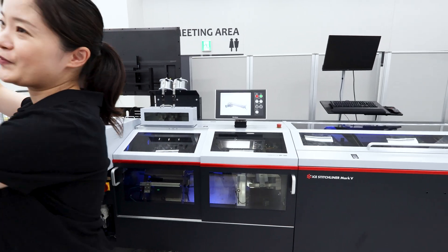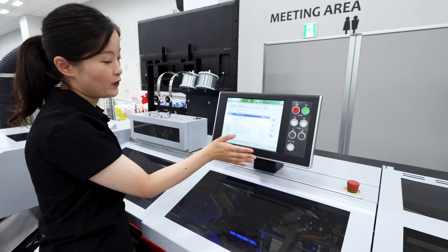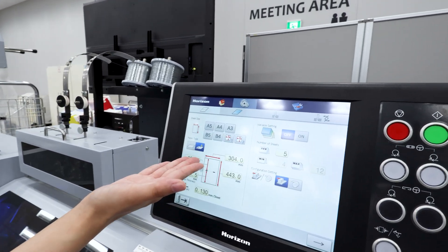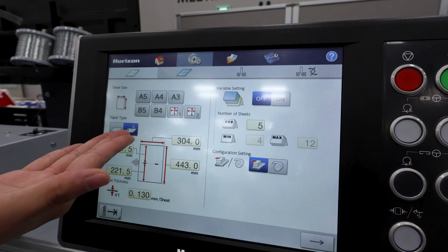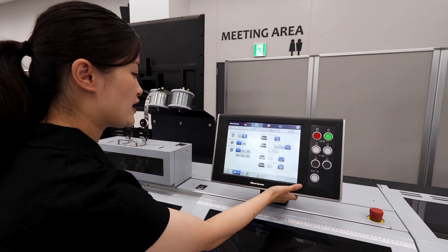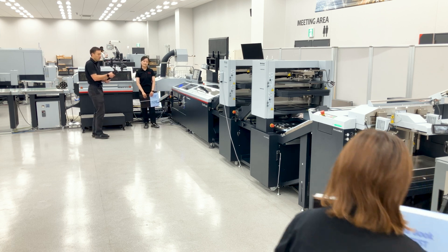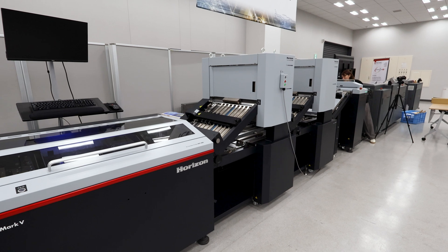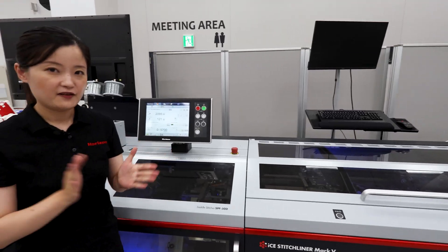And do not forget, we have today's maximum — we call it the blue notebook challenge. This one is also going to be retrieved from the job list. You can see it's already set on the coated paper icon, which means that the feeder will automatically choose the optimum settings for air value and air direction. Very easy to use. We are going to make five sheets per booklet. Going to the changeover. Very quick. Hirokawa-san is there helping with the paper loading. I'm ready for our second job.